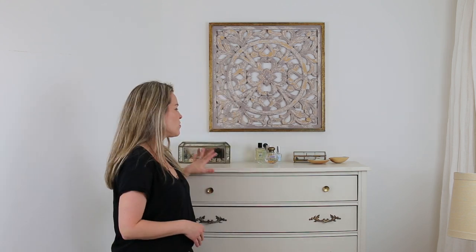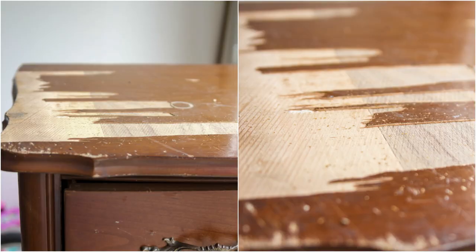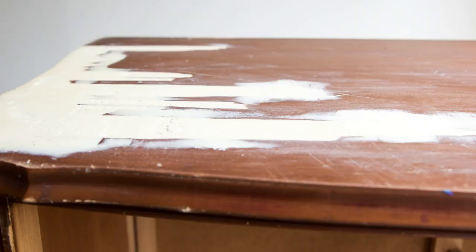All of these techniques are for painting furniture — ways to salvage furniture and then paint over it afterwards. For the first technique, you might have a piece of furniture that has damaged veneer. The whole top of this dresser was so badly damaged it was coming off in chunks and it was sitting on the side of the road because nobody thought it could be salvaged. With some wood filler and a putty knife, that will solve all your problems. With the veneer coming off, you do have to go over it multiple times, but when you fill in all the holes and gaps with your putty and sand it down — repeating a couple times — it'll have a smooth finish that's easy to paint.